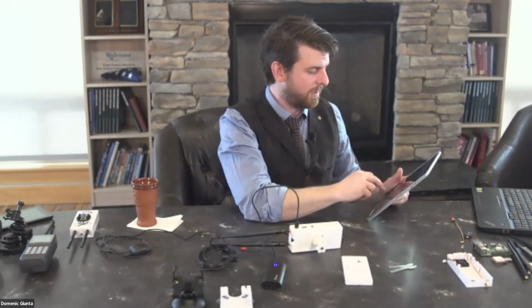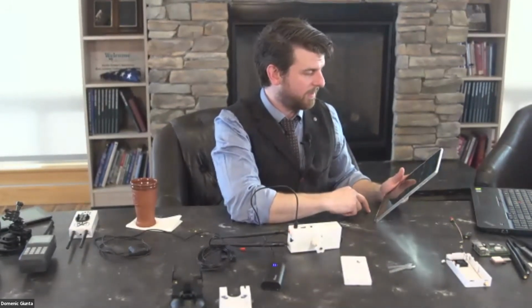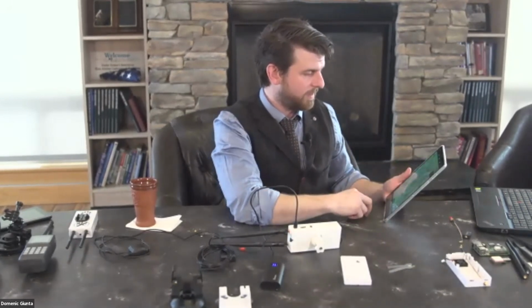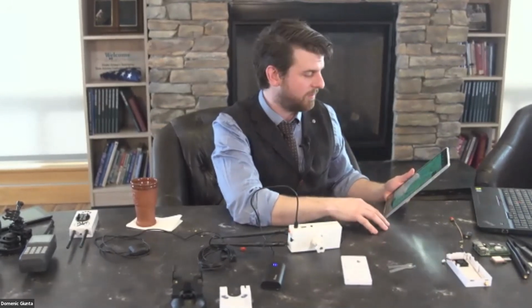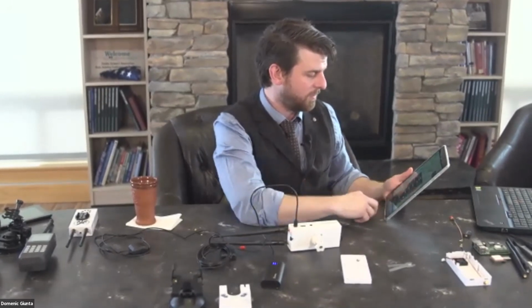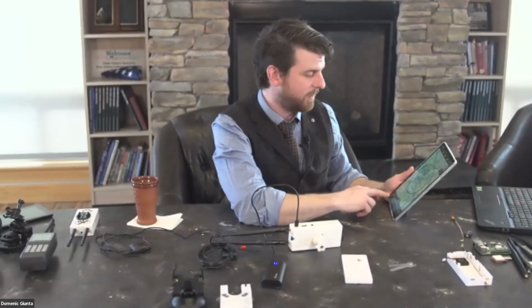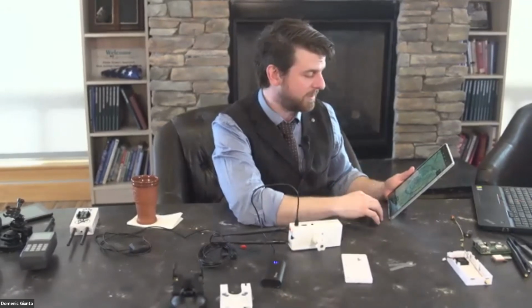And then once you are connected to it, like it's in a Wi-Fi network, you can go into your electronic flight bag. And depending which one you're using, if you're using ForeFlight, WingX, or Flight Plan Go, you'll go to the options menu and it will tell you GPS okay or GPS active, ADS-B up, or it'll just have a green circle that says ADS-B.